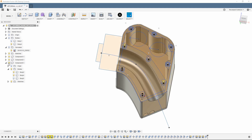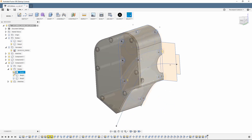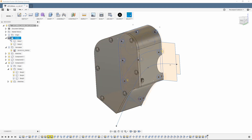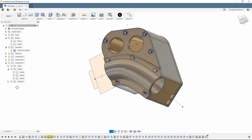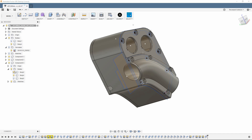I got a measurement off the diameter of the handlebar, ran a pipe in there, and designed around that — knowing I could have these switches fit around that handlebar. Basically I designed a front face with two holes for M3 bolts that go through to the other side with M3 nuts on the back panel, then screwed it all together into the PETG. I like using PETG for this sort of thing — it's a lot more durable, has more give to it, and is a lot more forgiving than PLA.